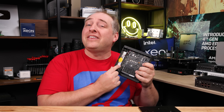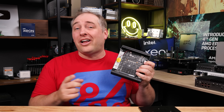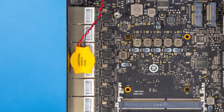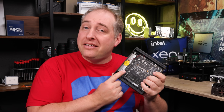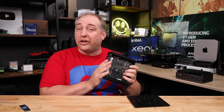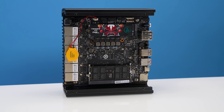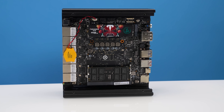Something you'll see along this side is that we have the Intel SRKTU NICs, which are the Intel i226-V NICs. Something that is a little different is that they are lower power because they're the new spin versus the i225s. What that means is that they're now on this side and they don't have a direct interface to the chassis for cooling. That is something important, and it's also why I do like the idea of having a fan. You'll see that we do have a fan header in this, so if you do want to put a four-pin fan, you could do that easily.